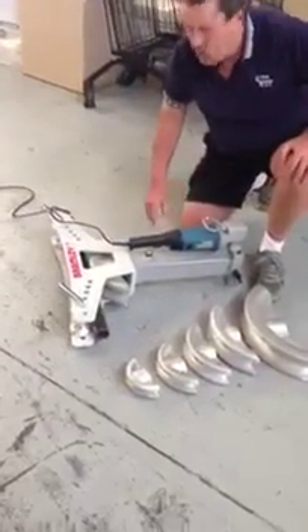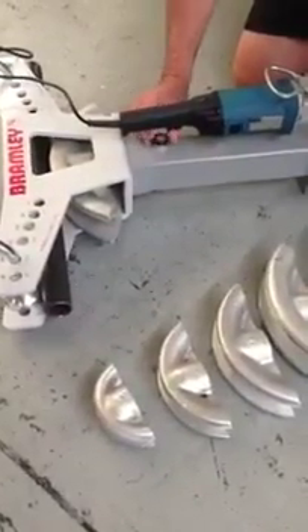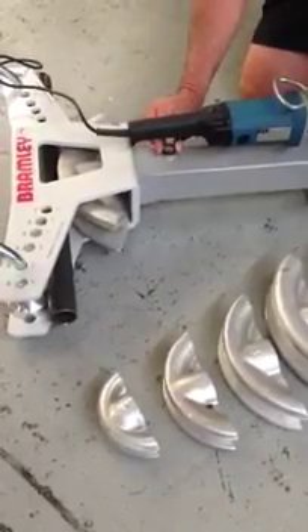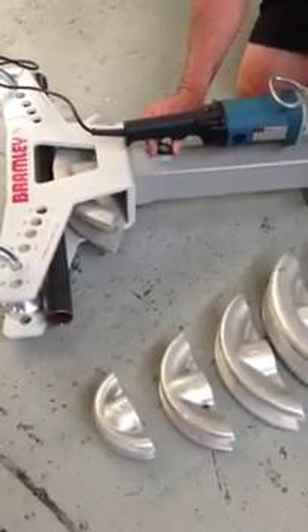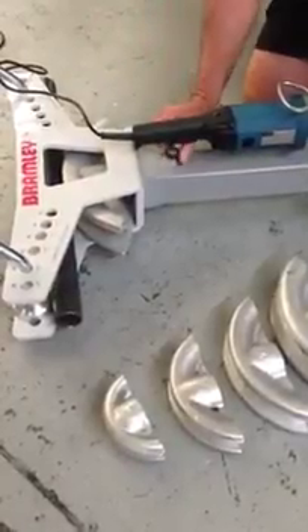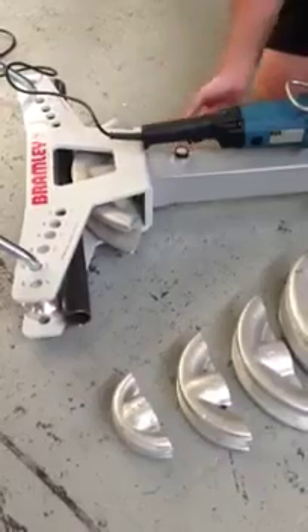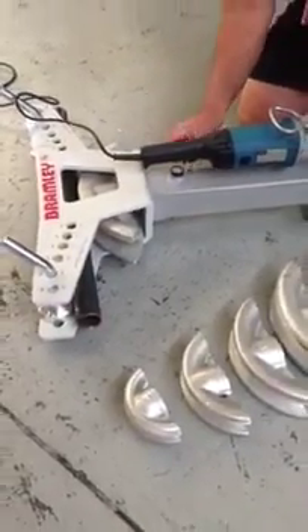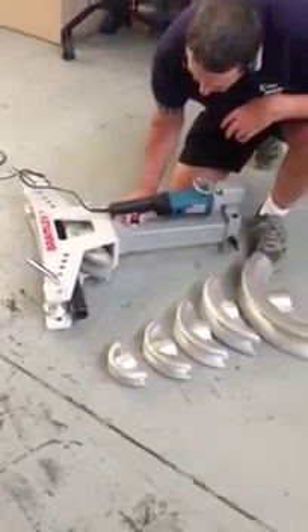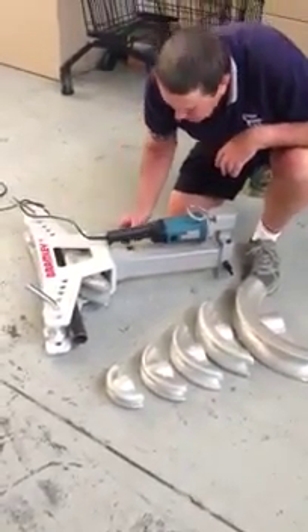Before we commence, this valve here serves two purposes. One, it's closed during transit so that no oil can escape and leak out of it. For operation, open it a little so that air can get into the outer jacket of the ram. If you pull it the whole way out, it also serves as a dipstick to make sure you've got sufficient oil.